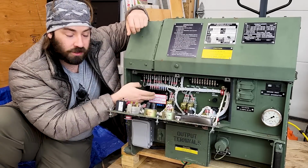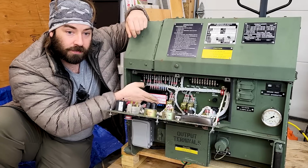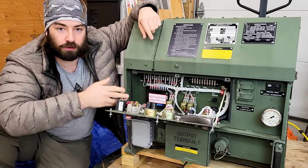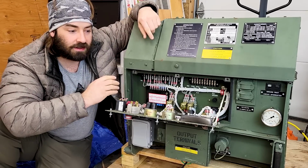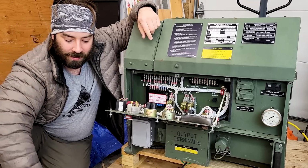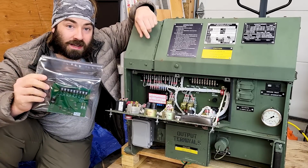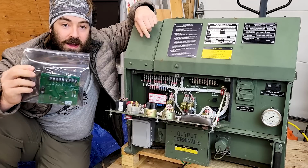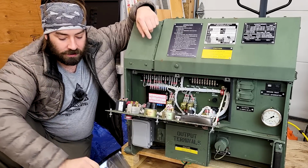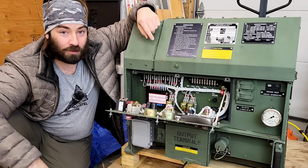Now this old governor controller has 4 potentiometers down here at the bottom, which all need to be adjusted in a very specific order. Now I went through that process and I still couldn't get it to idle well. So that's one of the benefits of going to Kurt's system. Kurt has eliminated all the potentiometers. Now it does it all automatically, and he pre-programs these. So I can't wait to get the new one in and then try it out again. Hopefully we have no more surges.